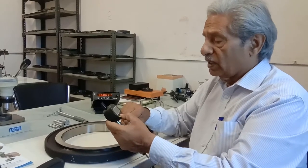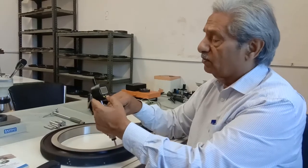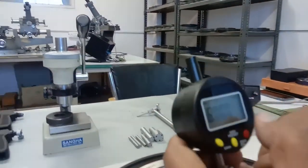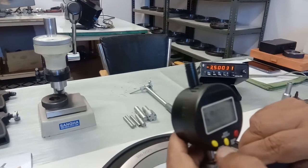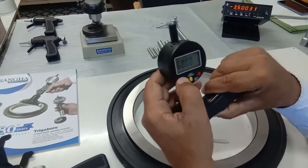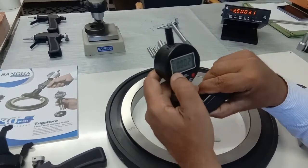To begin with, we have to basically preset the size of this ring into the dial gauge. The method of doing this is simple — we just press this button. The last digit starts flashing and I can change this digit to whatever I want. So in this case I'm going to set it to 2 microns. Step to the next one, step to the next one, step to the next one — in this case it's going to be 0. Step to the next one; this is 6.